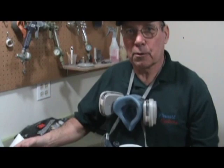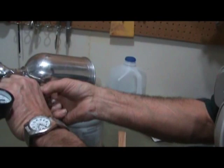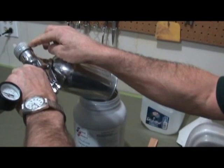When you're through spraying, take what's left in the spray gun and just put it back in the paint container, because it's a one-part material so you don't have any that you're going to waste. We'll just pour it right back in there. Then open the fluid control valve almost all the way out and pull the trigger — that'll let the paint that's up in this cavity drain back out so you don't have to waste the paint.